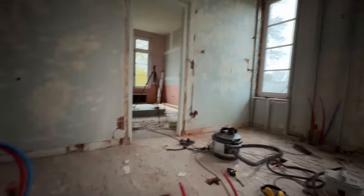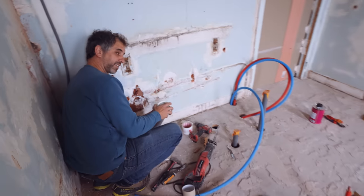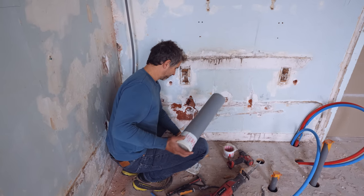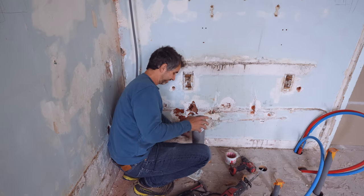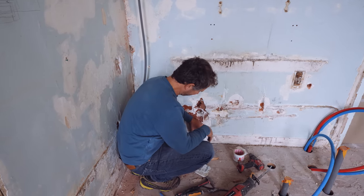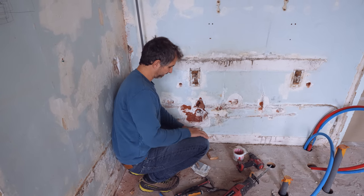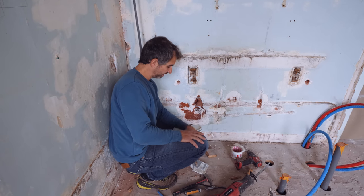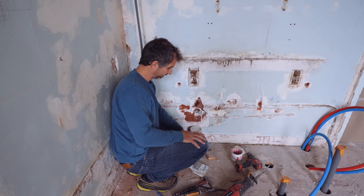We're upstairs now. Here we go. That's our pipe. Hey. How's it going? I'm finished. Oh, amazing. I have to block it now though, because it's connected now to the sewage system. So it smells. Oh yeah, I was wondering what that smell was. Yeah, it wasn't me. It was the pipe. So I put it in here, in place. And later when we have finished the toilet and the walls and everything, we can connect it to the toilet. But I don't know exactly what height the toilet will be. It needs to be at 18 centimeters from the floor. But as we don't know what we do with the floor, I have this temporary solution here.